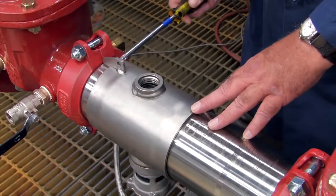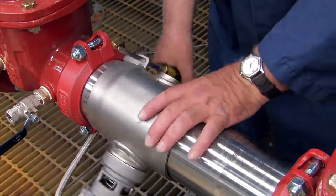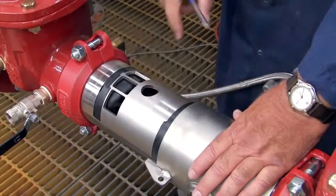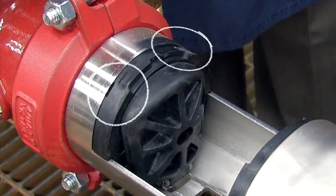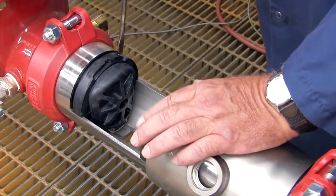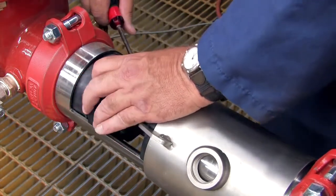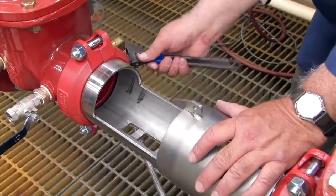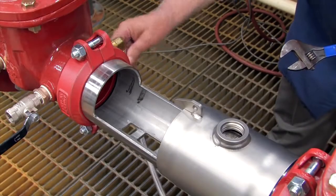To open the assembly, insert a number 3 Phillips head screwdriver through the hole on the top of the valve sleeve. Using the screwdriver as a handle, carefully rotate the sleeve left to right to break the O-ring seal, then gently pull the cover back. Remove the stainless steel check retainer plate. Locate the two slots found atop each check and carefully insert a flat blade screwdriver between the check and the valve body to gently slide the module towards the open zone. Pull the check free and remove it from the assembly — the number 1 check should be removed first, followed by the number 2. Uninstall the relief valve by disconnecting the sensing line with a wrench and carefully unthreading the valve from the bottom of the cover sleeve by hand.